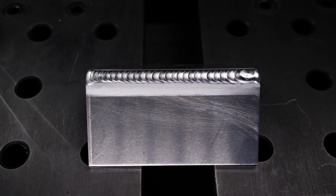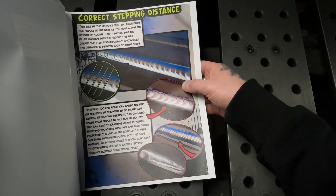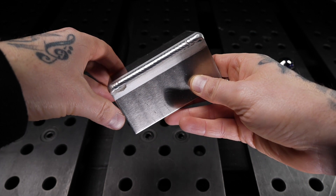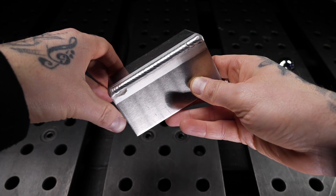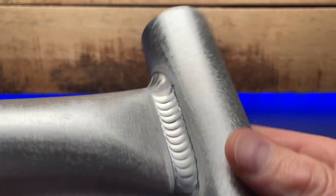The amount of filler I used was pretty much perfect. Next, we take a look at the stepping distance — the pattern looks pretty good, with the distance from each step remaining relatively close, and more importantly the consistency of my stepping remains the same for the entire duration of the pass. You can use the pages in this workbook for virtually any joint — different plate configurations, coped pipe joints, all kinds of tricky stuff. The next page goes over one of the biggest cheat codes you're going to find with TIG welding aluminum.